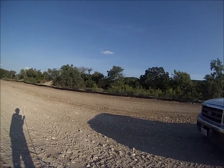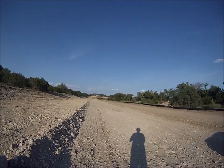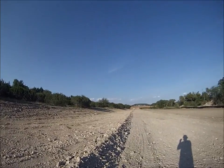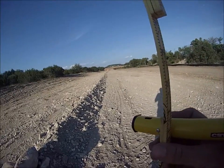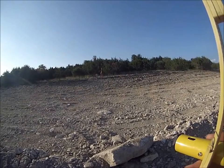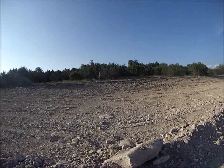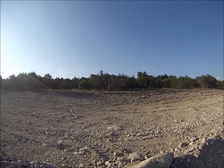Each time I shot it varied, but most readings were anywhere from 3 tenths up to 5 tenths difference from the silt fence to the toe at each station. That's what it all boiled down to — being able to shoot it and make sure your toe was not lower than the edge of the silt fence in between. Really, all I was trying to achieve is making sure I had positive fall. Hope that answered your question.